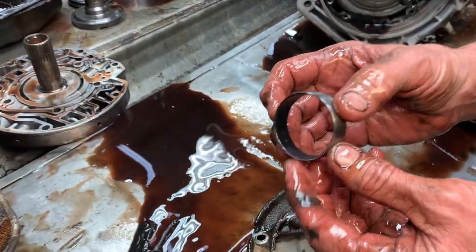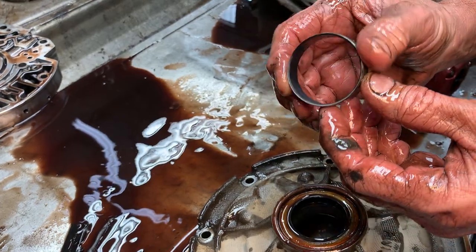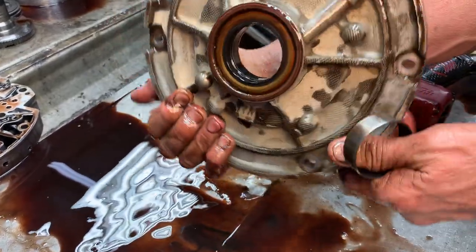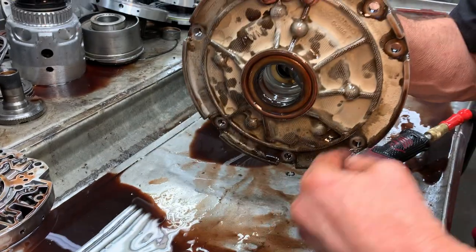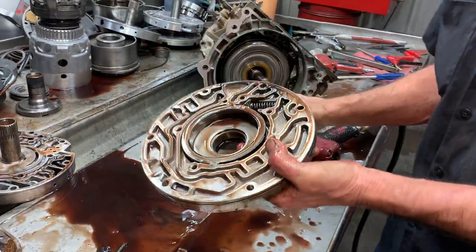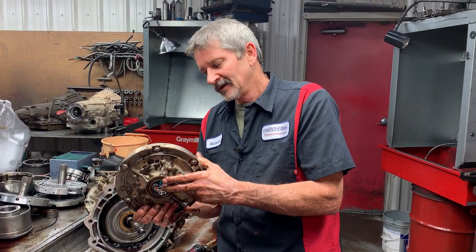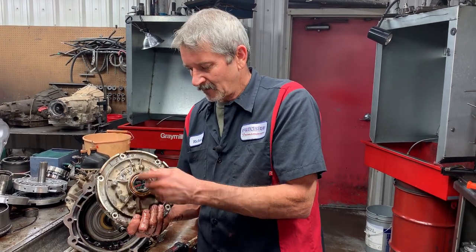If you look at one of our new bushings, see it's coated all the way around. This old one here has already lost its coating on one side - it's sitting in there off-center. The crankshaft and motor setting low, you know, starting to push down on here - multiple things. And even though this has been rebuilt, whoever lined this pump up and put it in there can cause this issue if they didn't have a pump alignment tool. Because if you get it off a couple thousandths, it'll still work but it'll move down and wear that bushing out.